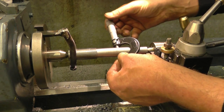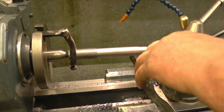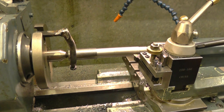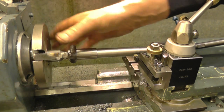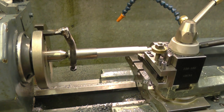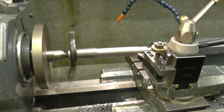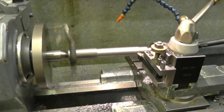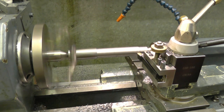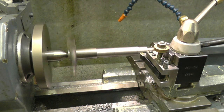I've taken my roughing cut off and I'll take the roughing tool out. We're going to the finishing tool now with a nice new tip on it. Screw the feet down a bit. You can't run the lathe too fast because it will be out of balance with the driving dog on. What you could do is put a counterbalance weight on there, but for what I'm doing I think it will be alright. I'm going to touch that off and zero the cross slide.